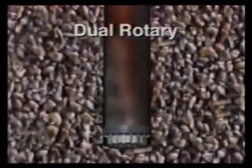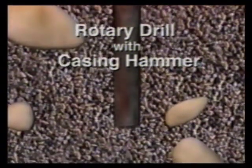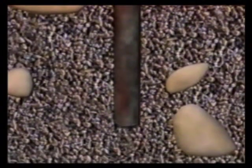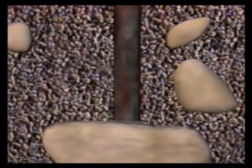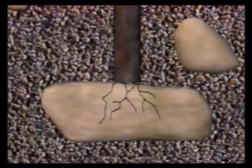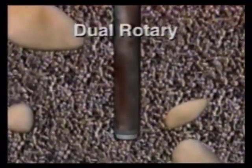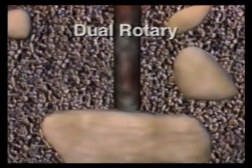Compared to conventional drilling methods, the Barber dual rotary rig offers a number of important advantages. It operates quietly, with no vibration, unlike casing hammers that can be noisy and are irritating in populated areas. In addition, when a casing hammer encounters a suspended boulder, its progress may be hampered, and continued efforts to crack the boulder may result in damage to the casing. The Barber DR, with its rotating carbide tip, can cut and set casing straight through the boulder.